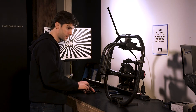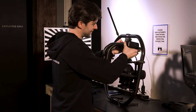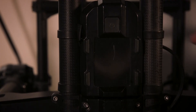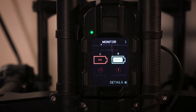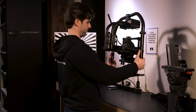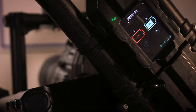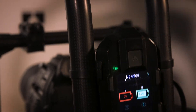Once the battery is balanced charged, connect it again to a Movi Pro gimbal and observe the charge percentage in the Movi Pro control unit. If the battery displays an initial charge in the 80% range, then you should mark it damaged. If the charge state is more than 90%, then lift the Movi Pro and turn the balancing ring left to right to stress the motors. If there is a drastic immediate drop in the charge percentage and the Movi Pro powers off, then mark the battery as damaged. If there is a drastic immediate drop and the charge percentage recovers without the Movi Pro shutting off, then mark the battery as good.